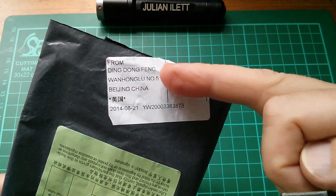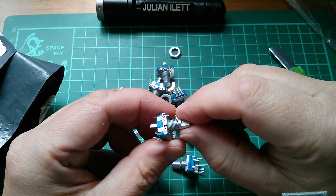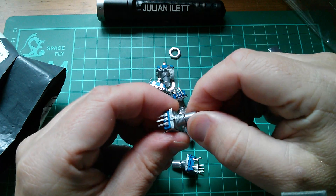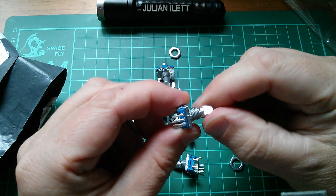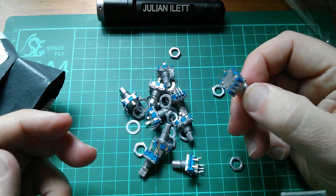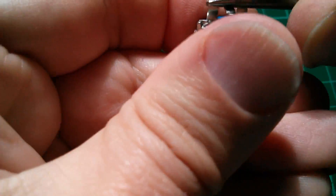Next we have this, and it's from Ding Dong Feng. This is the one that rattles. So let's see what's inside - and it is lots and lots of these little rotary switches with a click switch and 20 positions on the rotation. Two pins here for the click switch and three pins here for the grey code outputs to indicate that a step has been taken. One of the reasons I bought these, and bought so many, is because I want to take one apart. So I've managed to get this bottom bracket off.